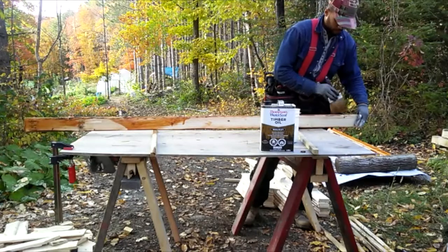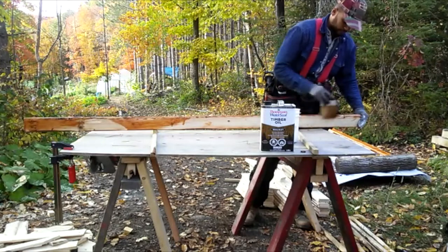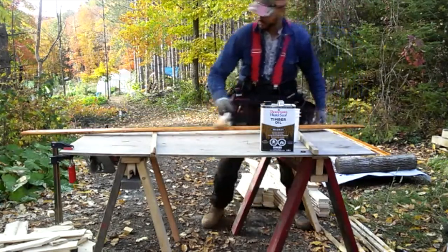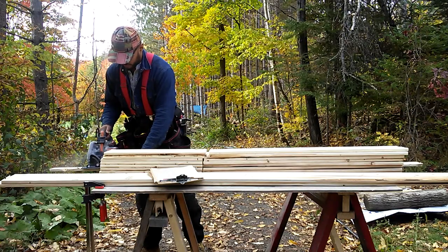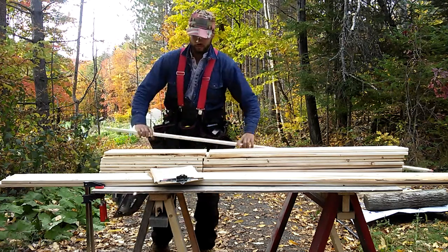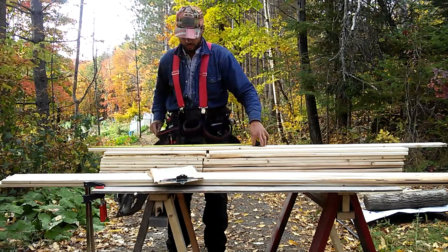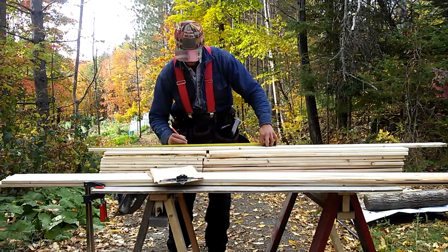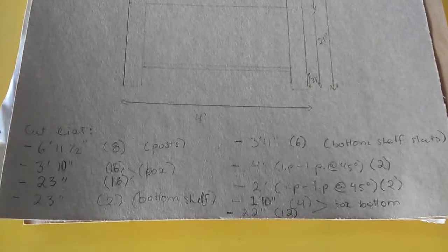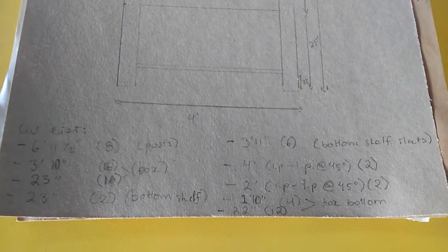Make sure you have a good working area — if not outside, somewhere you'll be able to clean adequately. If you don't have sawhorses to cut on, consider making them out of 2x4s, or use a pair of old milk crates. The circular saw is probably the most dangerous tool I'm using for this project. If you've never used one before, I'd recommend having someone experienced show you, and if that's not an option, consider working with a handsaw — you can do pretty much any cross cut with a good handsaw. From your design you'll want to come up with a cut list: an extrapolation of the design that details the quantity and measurements of pieces you'll be cutting. I like to keep my cut list with me as I work.